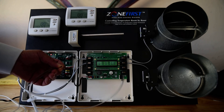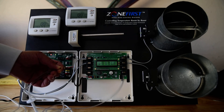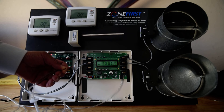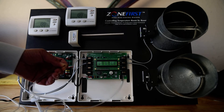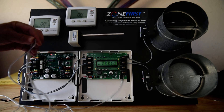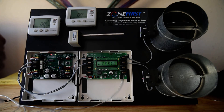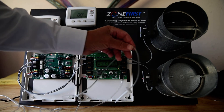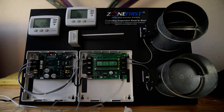There you go — once the static pressure in the supply air plenum stabilizes, that damper stops moving and that's where it stays. So now I am relieving air down the non-calling zone in order to avoid built-up pressure. It's quite simple and it's an amazing step forward to eliminate the need for a bypass system on a standard unitary or even a heat pump air conditioning system.